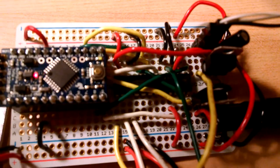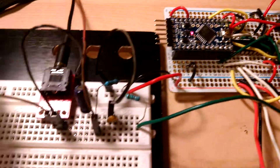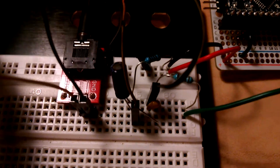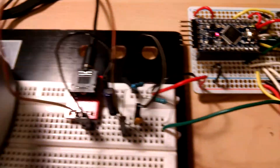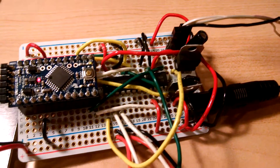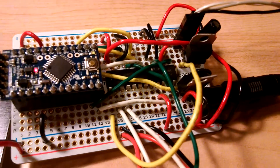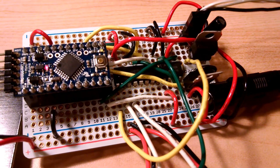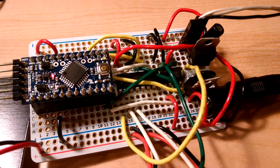This is the board with those parts on it. There are still some pieces on the breadboard — basically just the low-pass filter and the audio jack. This is all running from a 9V battery. On the board there's a 5V regulator and a 3.3V regulator. The 3.3V is used for the reference voltage for the ADC and the DAC, and for the mic as well.